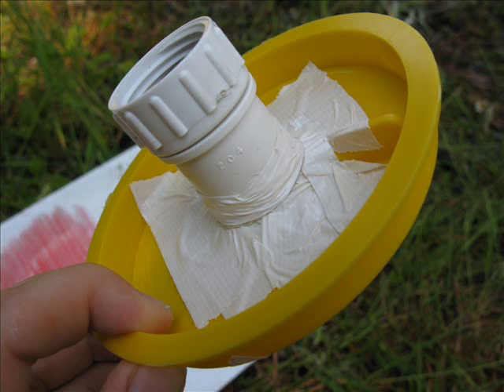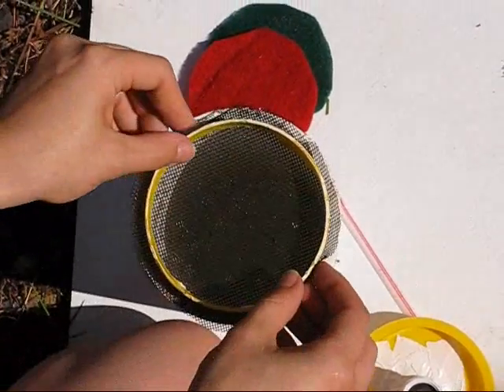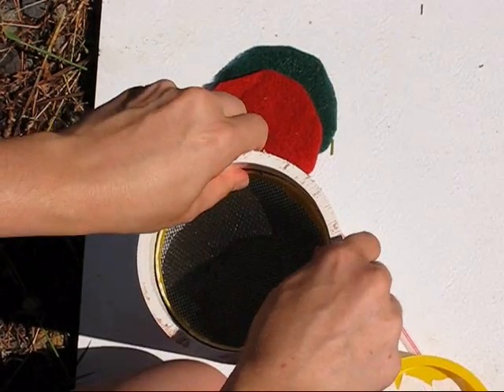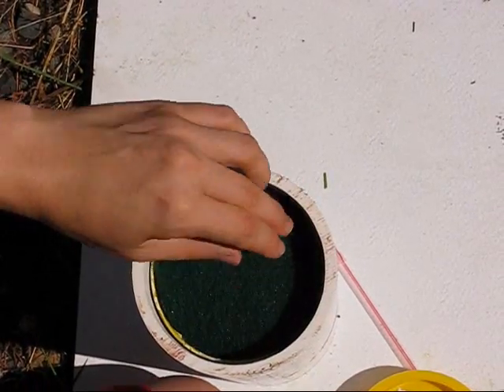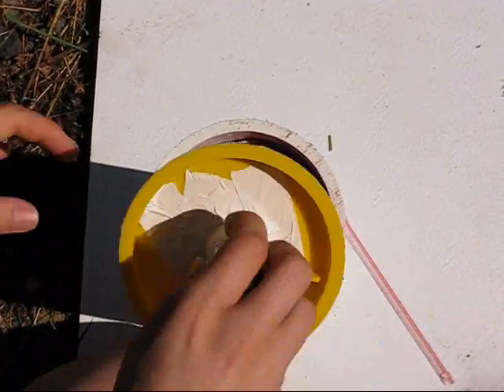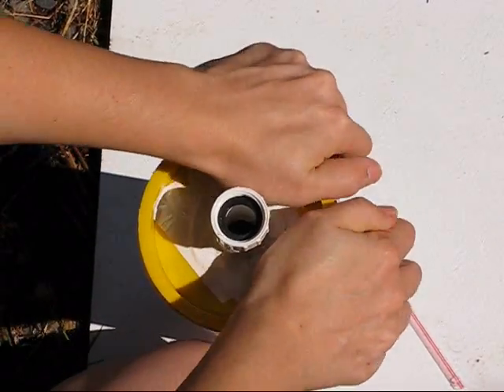For testing purposes, duct tape the hose adapter to your inlet, making it secure with tape on both sides. Place a plastic ring over a mesh circle and slide both roughly an inch and a half into the 4-inch PVC pipe — it should hold the mesh firmly in place. Place both scouring pad circles gently into place over the mesh, then snap the inlet test plug into place. You may need to tap it in place with a hammer.